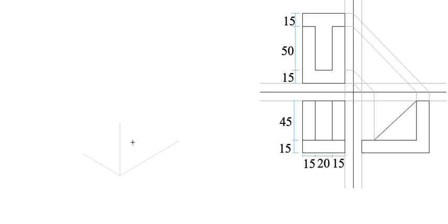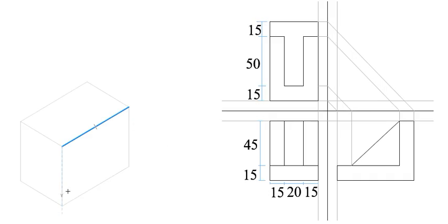You have to make it look like a box. This one should go up 60 millimeters at 90 degrees, and this one also at 90 degrees, 60 millimeters. Then join this to this at 30 degrees. So you have your isometric box right there.